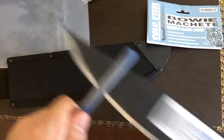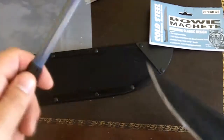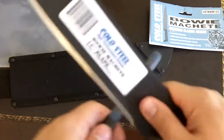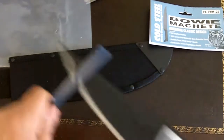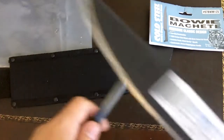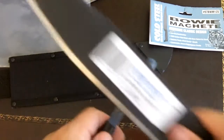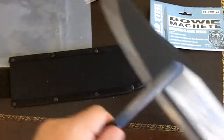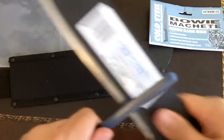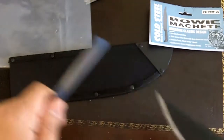When an edge gets burned with a grinding wheel, because of the high temperatures, the heat treatment gets ruined there, and you have to go through more material. You have to eat up more material with whatever sharpening method you're using, so as to reach where the steel is as it's supposed to be, where it's harder. That's usually what you see when edges get burned. A knife can be completely ruined by the temperature reached when using grinding wheels or belts. When you use a belt and the temperature is too high and you're not controlling that, not using at least a little bit of water to bring down the temperature, there's a good chance that you may ruin the temper of your knife. And yes, you can have it sent back and retempered, but it's a huge can of worms. Better to just go about it slowly.